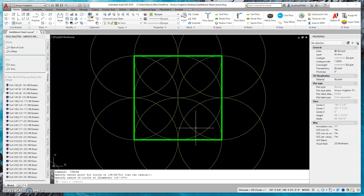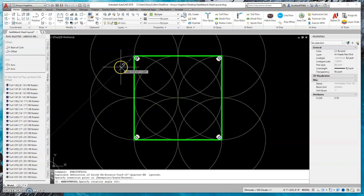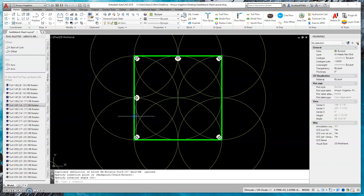You could do it with 15 foot spray heads, or they make 15 foot rotators. I like the rotators — they're higher uniformity — so I'm going to choose those. Now I'm putting in my 15 foot rotators, my halves, and then my full heads. And that's the completion of this design.